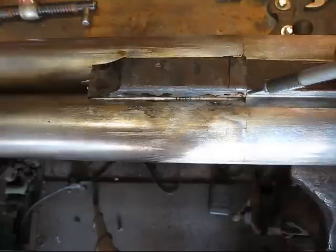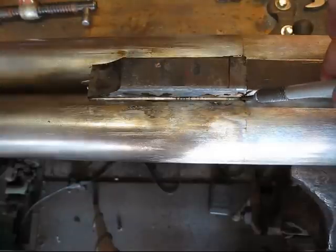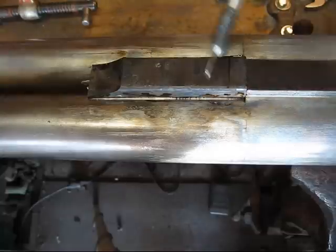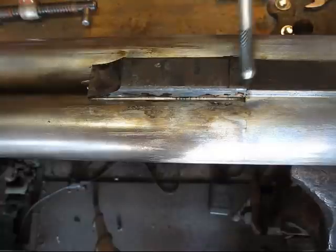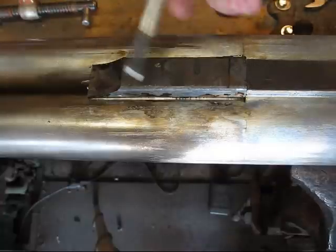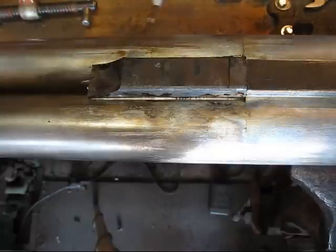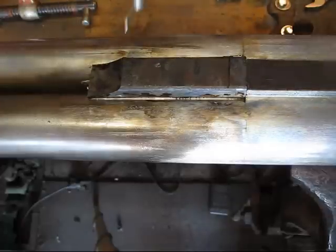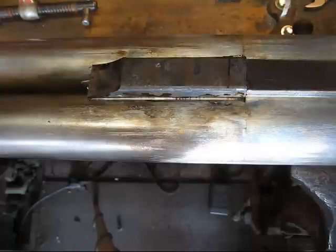Once that's cleaned up, that'll completely disappear. It makes a really nice solid joint all the way around. The more stuff you start putting on these barrels, the less access you have to the inside edges of your joints, and so you've got to start working from different angles to get this stuff to really attach and make good joints and bonds. But that's how it's done.